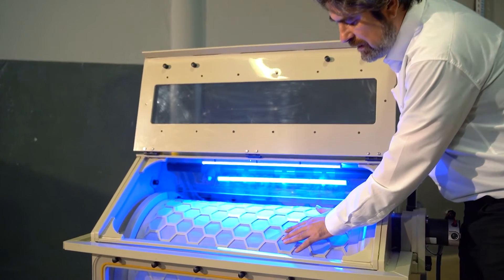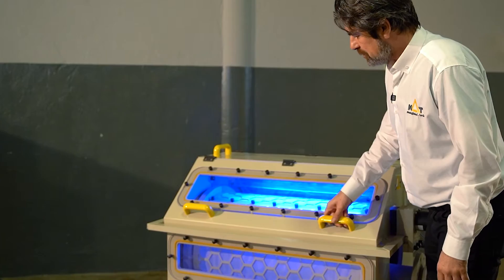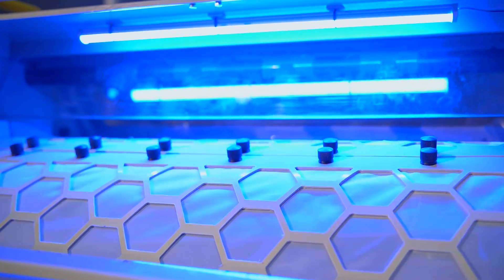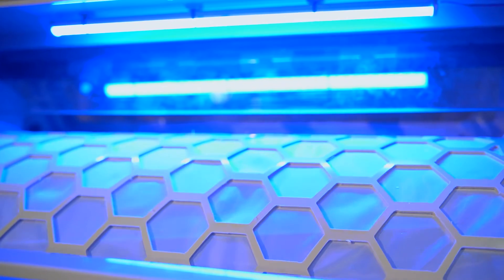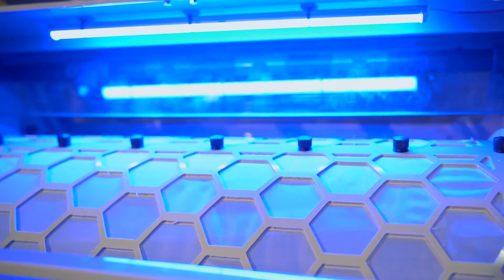As you can see, we don't have any metal parts on the unit. The mesh inside is currently a polymer mesh at 100 micron, but it's possible to go from 10 micron to 500 micron. We can also use different materials depending on the application — stainless steel or duplex.